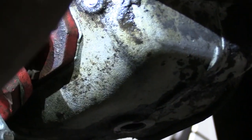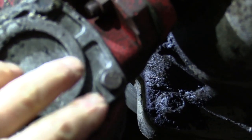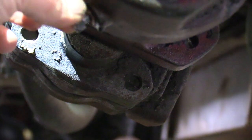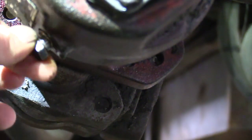We're coming to the transmission — this is a T2080 transmission with live hydraulics and a PTO. There's a drain plug right here — that's where you're going to drain it. If you have the PTO, it's going to leave probably a good quarter or better of fluid in it once you drain the transmission. What I do is take that bottom bolt on the PTO loose — it's 35 to 40 foot pounds and it has a copper washer on it that seals it up.